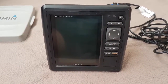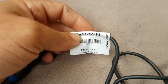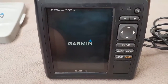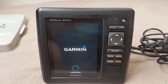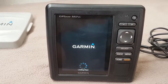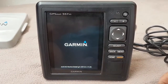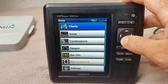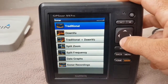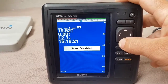I've got the GPS 557 XS connected with that cable in-line, using that same aftermarket GT20 I described. This is what happens when you turn it on through the 12-pin connector — the Australian/New Zealand mapping loads and, voilà, the GPS Map 557 XS now shows traditional and down view options. When it was on the 8-pin and didn't recognize the transducer, there were no sonar menus at all.